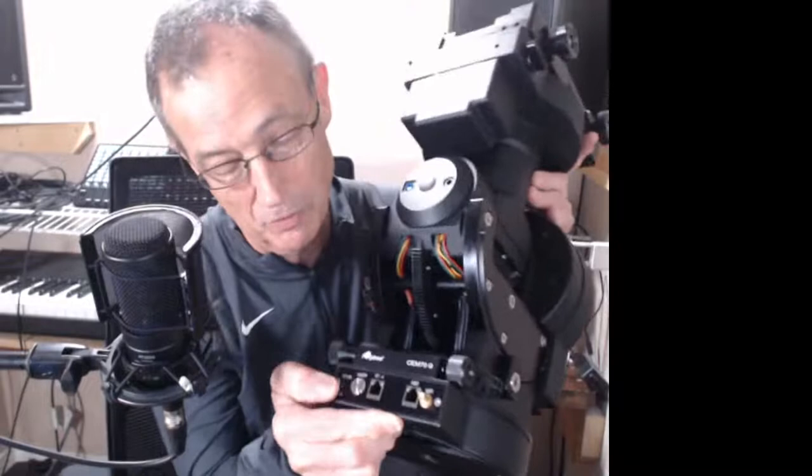The 12 volt auxiliary circuit is not used right now. The mount has its own separate 12 volt power supply that still has to be run, and that's what powers the mount. In my case, because the in-mount USB didn't work, and rather than wait weeks for iOptron to send a new board, I needed something else. Basically I need a dependable way to get power up to the scope for the primary camera, and a way to bring the USB 3 signal from that primary camera.